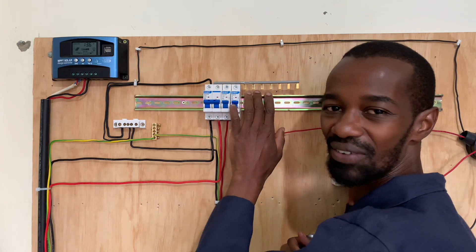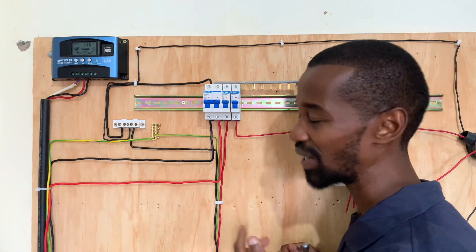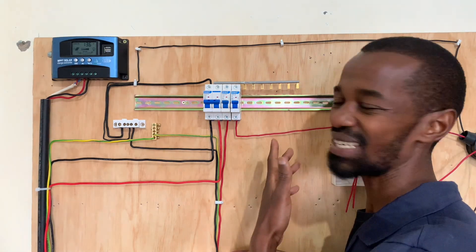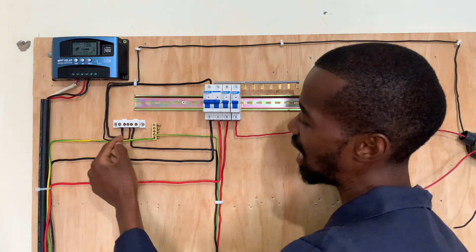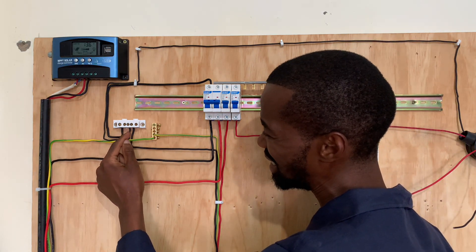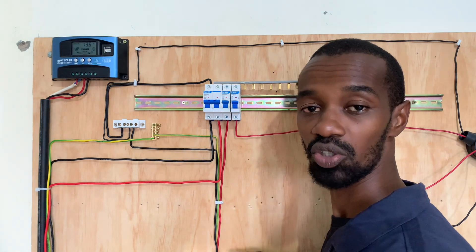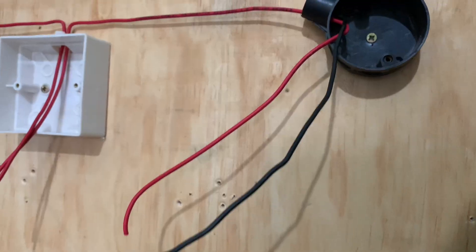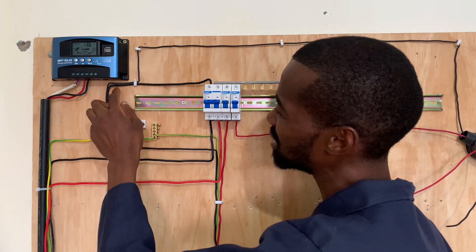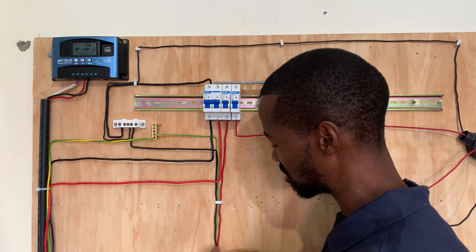At this particular point we can have as many MCBs as we want, depending on the circuit being introduced — be it the instant showerhead, the cooker in the kitchen, an extra socket, or for a pump. We'll have the neutral connection for the lighting connected here from the neutral bar all the way to the lighting source, because the neutral does not go through the switch — it goes direct where the bulb is connected, be it a bulb holder or a ceiling rose. When it goes to the socket, we tap the neutral from the neutral bar and connect it directly to the socket.